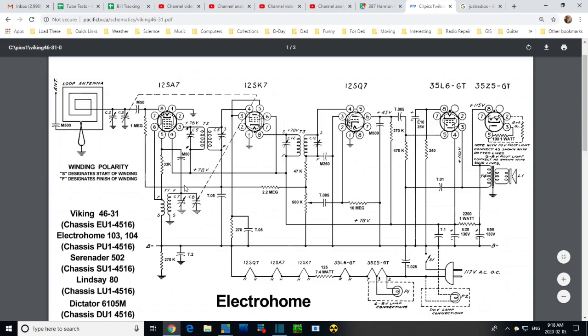Okay, so how can this possibly operate if it's open? So I suspect that wire is not really broken on this thing. And I have tuned this radio. It has tuned things in. There is an oscillator signal reaching the tube, and it's pretty close to appropriate in frequency. Hard to believe how you could have any problem in this coil and have A, the thing oscillate at all, or B, oscillate at the right frequency. So we've got to take a close look at this, because maybe there's really nothing wrong with it at all.